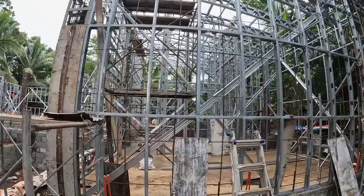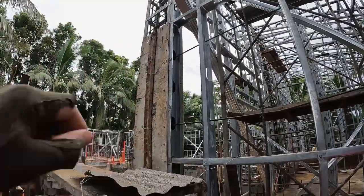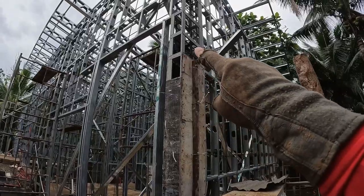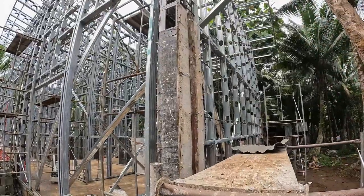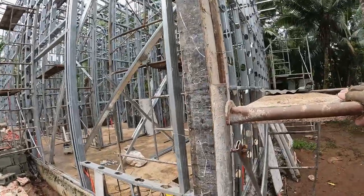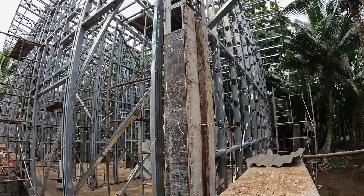Let's take a look at the latest progress on metalite construction. Since the last episode I showed you how they put the rebar inside the metalite frames, and now they're working on enclosing the columns and getting ready to pour those. They've got steel stringers every foot and a half or so up and down all sides of the column, and then just like the traditional method they're using plywood forms to enclose the columns. They take that a step further and use self-tapping screws to hold that plywood form to the metalite part of the form.